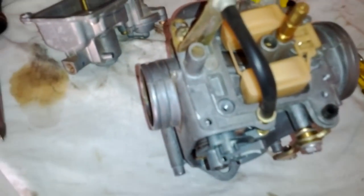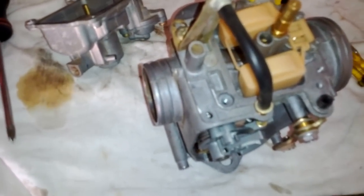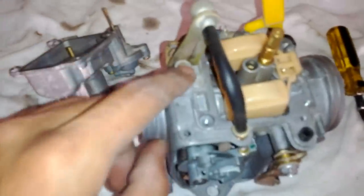With this pilot screw, you have to turn it in and count the number of times it's turned. So I recommend you use permanent marker to mark your screwdriver and count how many times it turns. Well, mine only turned half of a turn back. I don't know if that's normal or not, but it comes back and not even the full turn before it stops. So mine was just half a turn, and yours might be more. Something seems wrong with mine, seeing as how it says just to start it, you need to do 2.5. Well, remember that, it's half a turn back.